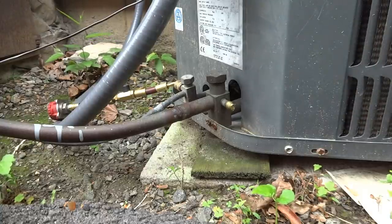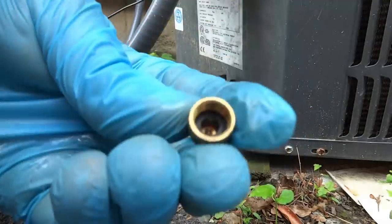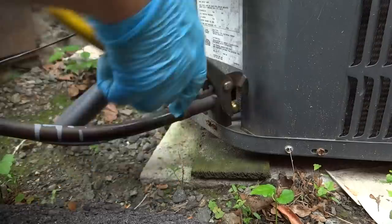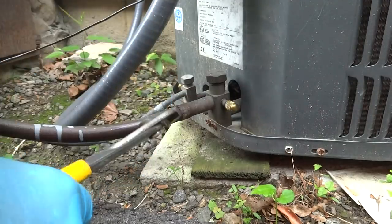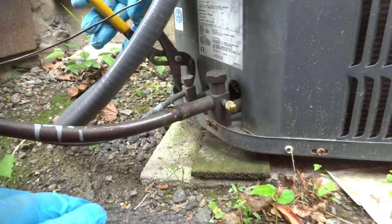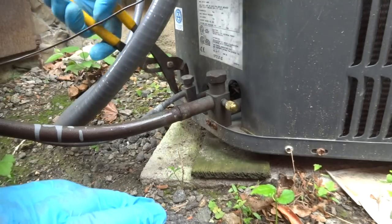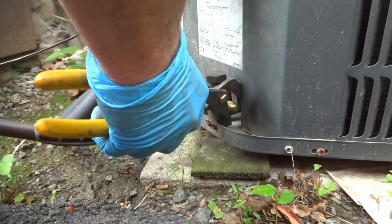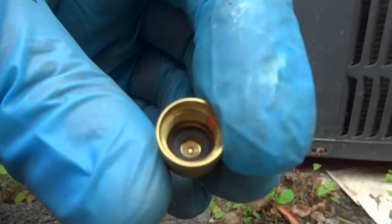See, that's got a tiny leak on that thing. Let's see how it's getting nice and sweaty. These JB caps have a nice rubber on there and we'll crank them in - that won't leak. It had that other cap on there really tight, so that's why it hasn't been leaking. The Schrader core's leaking a little bit. I'll fix it right there - it's got a nice gasket in there.